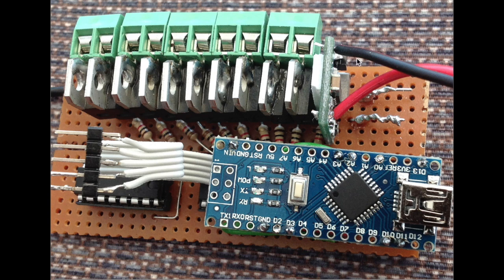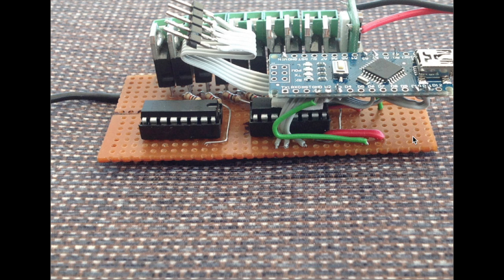I also, at this stage, I think it's a buck converter, when it goes down. So there's 12 volts in, and the reason for using the 12 volts down to 5 is that I needed a supply for the sensors. So here we have the negative, so that's basically on the negative rail. This is the new positive rail of 5 volts. So negative and 5 volts. Obviously I'm going to say a communal negative, but it's not really.